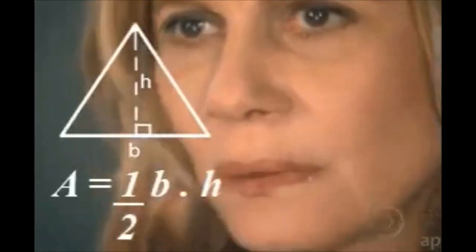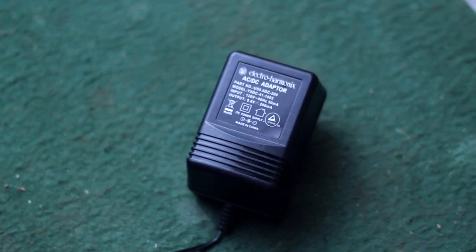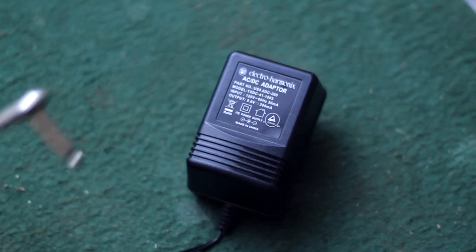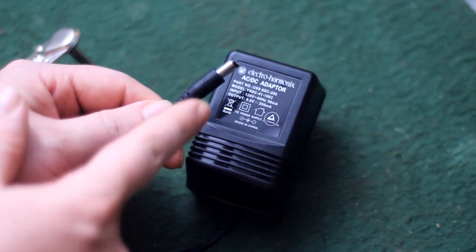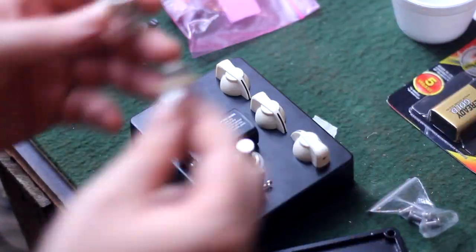And this whole deal is further confusing and complicated by the fact that the Boss standard power supplies that pedals use are center negative. People refer to this sometimes as positive ground, but it's actually not. Your pedal enclosure and the sleeve part of your instrument cables are still negative. It's just that the wiring on the barrel plug of the adapter has been switched. So now you know why I needed a big old box with a space for that battery, and also chicken heads are pretty big.